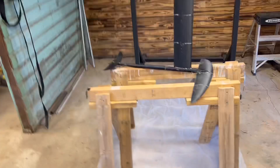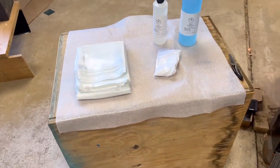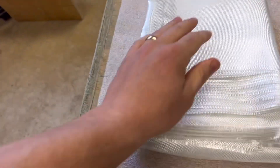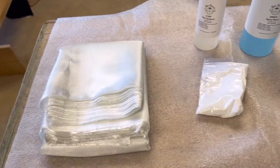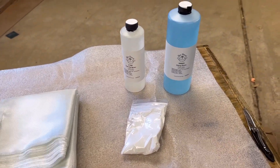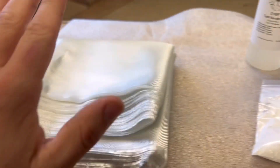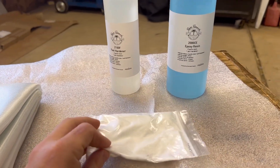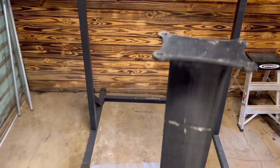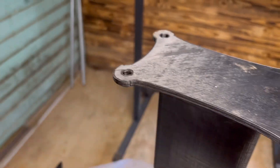Today we are going to start fiberglassing our hydrofoil that has been 3D printed. There is the foil, and right here is all the fiberglassing material we will need — ordered from Clearwater Hydrofoils, I'll leave the link in the description. It was a complete kit for about $120 with free shipping. We have our resin, the hardener, and the fiberglass. This bag is a powder you mix with the epoxy to fill in the holes so that when you re-drill through these, you have epoxy all around that so water doesn't penetrate the plastic.